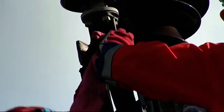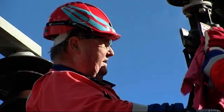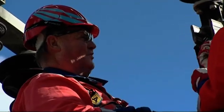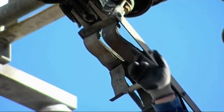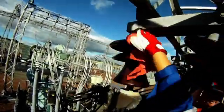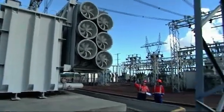So what can go wrong if I don't clean it? What can go wrong when they're not cleaned is that the switch won't operate correctly. Would you get sparks? Yes you do. It's known to us as corona. Keith spots a problem on a conductor connected to the switch. This here is a broken braid and needs to be replaced. The fault is logged — that's something for another day.